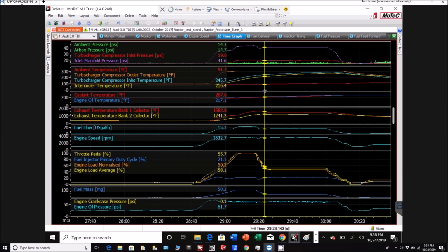But as you can see, the limiting factor there is the air coming in through the intake, because the oil temps and the coolant temps just continue to rise, since it's not getting enough airflow. Obviously when it's flying, that will be much, much better with moving air. It's generally better also when I'm doing tests up the runway. But overall, it was a good test. So I know kind of what's going on and how much I can push the engine for takeoff and climb out.